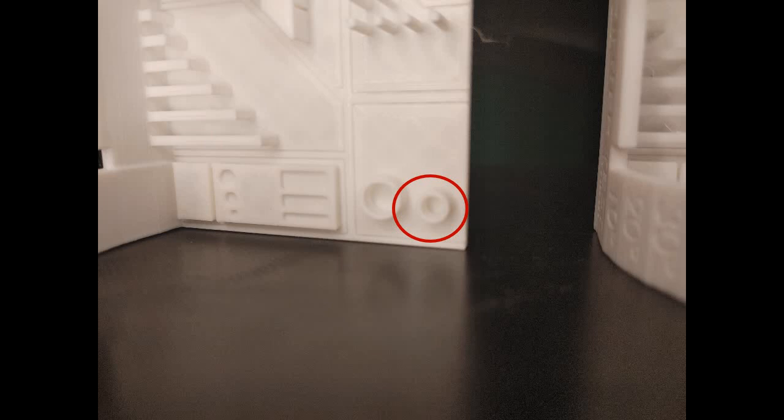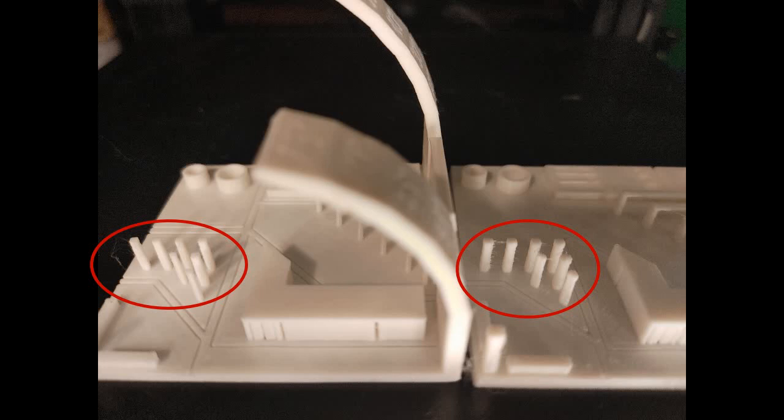The next thing we're gonna look at is the circular shapes — these are inner and outer diameter tests. On the Ender 3 they came out pretty much flawless, nice and round, and it worked out really well. When we look at the Genius model, this bottom perimeter of the right circle — highlighted in red — is a little bit thicker than the rest of the walls, which is a deviation and a flaw in the print as far as perimeters and dimensions go. Also looking back at the bridging on the Genius model there is a little bit of stringing and droop from the second shortest bridge. And finally, looking at the stringing: the Ender 3 pillars had just a little wispy string off one pillar, while the Artillery Genius shows quite a bit of stringing on the pillars.